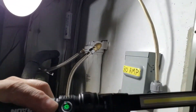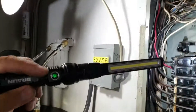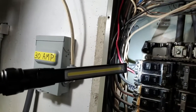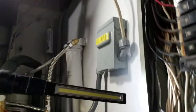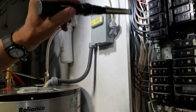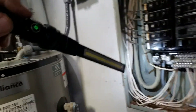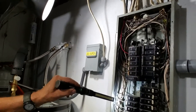This is the 30-amp fuse. You see this red and black, and of course there's a white and brown — that runs the dryer. That was the breaker servicing the double-stack, the piggybacked line that fed out and was hooked up here. You can see back here and down here — back in the day they must have had a technique where they twirled or braided them, because I haven't had one stinking line come straight from a service entry. Down here they're all twirled and intertwined. I guess that's the way they made them look neat back in the day, but it's a pain to deal with.